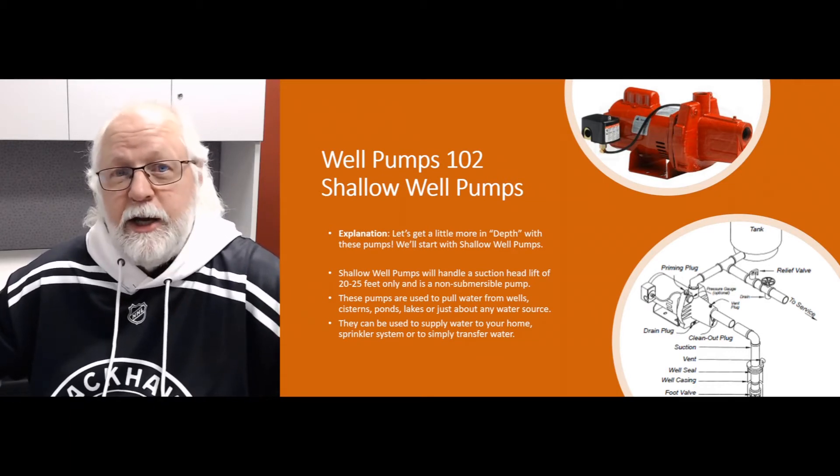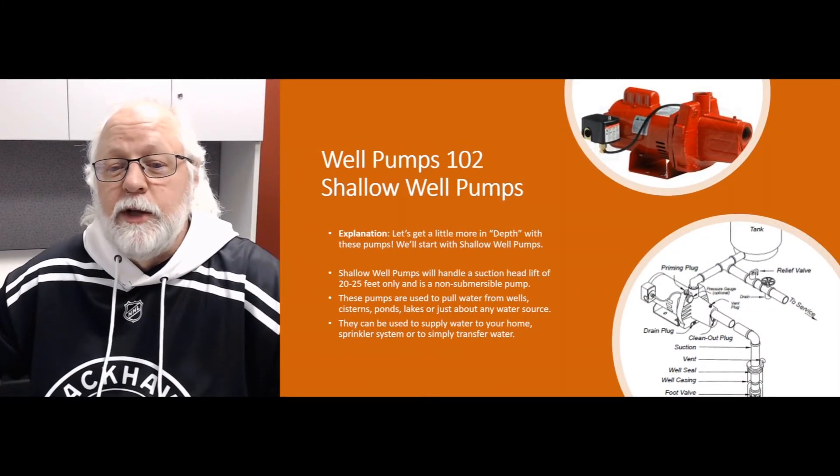On the flip side, if you're running a long distance on that discharge — three, four, or five hundred feet — you're actually going to have to increase the diameter of that piping to minimize friction loss. The longer the pipe and the smaller the diameter, the less surface area there is and the more friction the water encounters moving through that distance. Longer distance means more friction loss — you're losing flow and pressure. You need to increase the pipe diameter to maintain your GPM and flow rate that the pump is designed for.